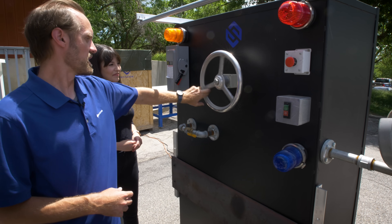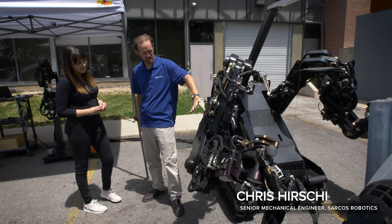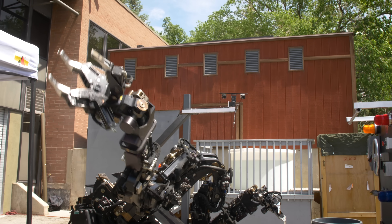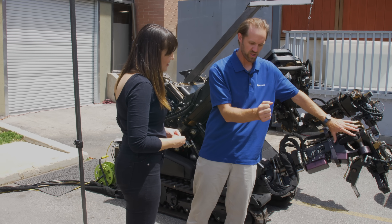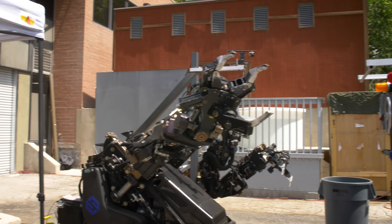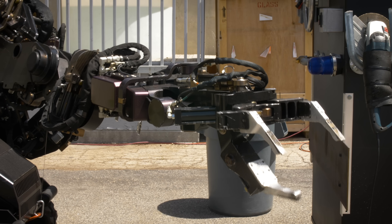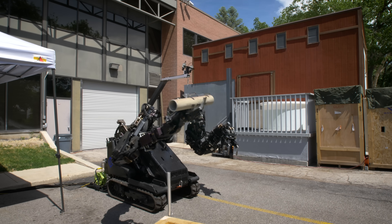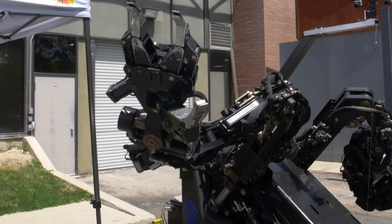This is Chris, who's going to walk me through the machine before I get to try it out myself. So this is our shoulder joint right here — a joint that allows rotation about the upper arm. This is our elbow. And down here we've got a joint that allows wrist rotation, and then two more joints that allow the other two degrees of freedom of a wrist. And when it comes to the fingers, it's really a claw. It's got two fingers that can open and close, and a thumb that can close to grip things as well as swing out of the way and allow a flat, palmed action if you need it.